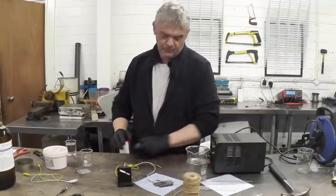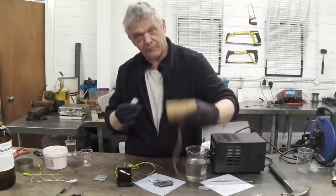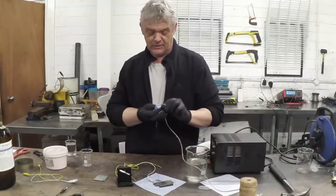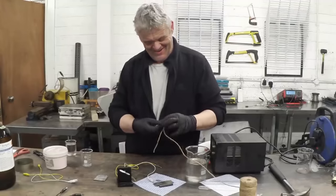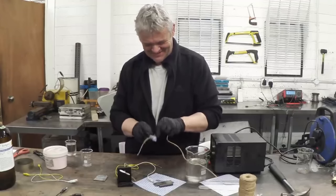And that will make the cathode. The anode, obviously, we're using a bit of zinc, and here it is. It's a zinc dry cell that I removed the rod from and then flattened, because this was again another one of those where you were supposed to use amalgamated zinc. That is, you rub the surface of the zinc with some mercury. And if you're going to play with anything dangerous, then certainly mercury is top of the list.